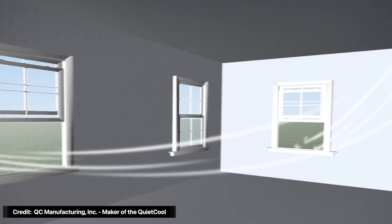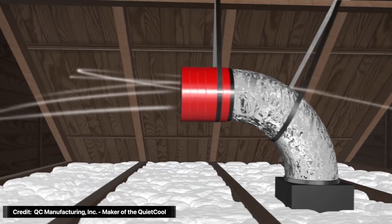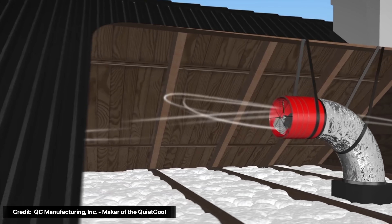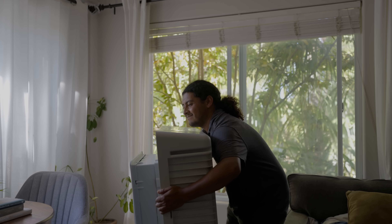The third option is a whole house fan — I had one in my previous house and loved it. What it does is take all the air in your house and blow it up into your attic, then the attic gets pressurized and pushes all that hot air out through the vents, cooling the attic as well. Our current house doesn't have a whole house fan just yet, but as the summer has officially kicked in I think we need to install one.